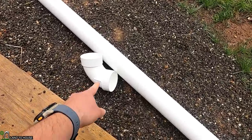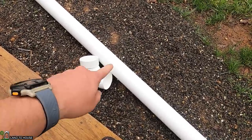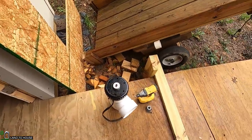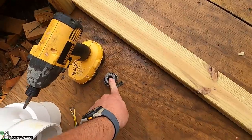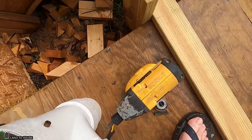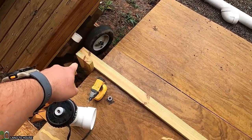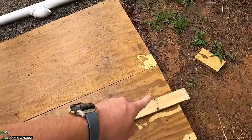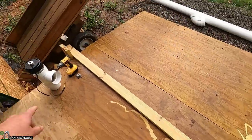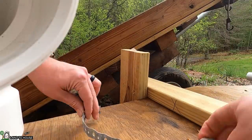It's been a couple of days. I had to go buy one of these 90-degree fittings. I also got a cold, so if I sound a little weird, sorry about that. Also four-inch pipe. Let's go ahead and mount this over here. My thoughts are I can take some of this plumber's strap and basically attach this right here to that board. Then I can measure and cut the PVC pipe here and it will go from here on over to where the 90 fits in. I'm going to have to go buy some more of this plumber's strap - don't have quite enough.